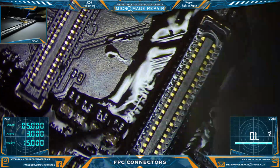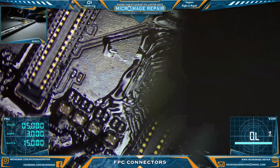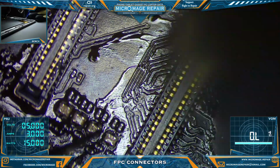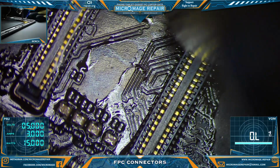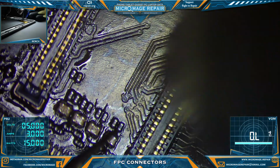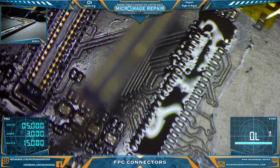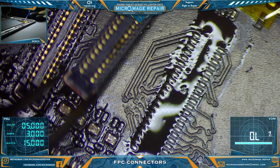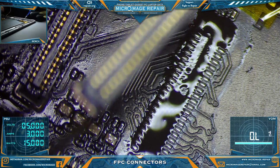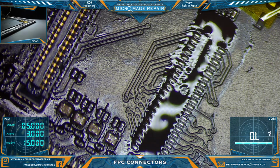I think we'll probably want to do some rapid air movement on this because there's a likely chance we could burn something else at these temperatures. So you want to keep the air moving. Alright, now we're getting progress. Okay, oops. Just threw my air, but anyway, I did remove the air at the same time as we pulled the connector. That's key. You want to have the airflow off the connector when you pull it. Otherwise, it will melt right there in your tweezers. Okay. Set it aside.